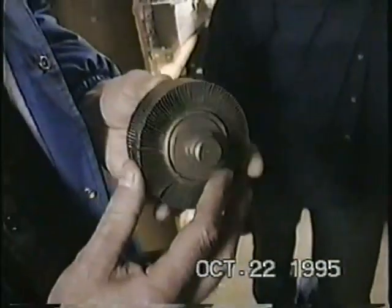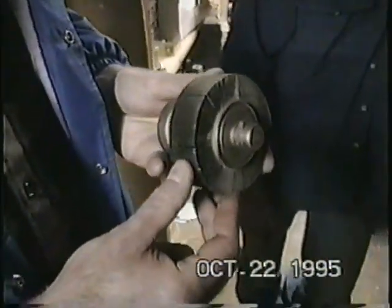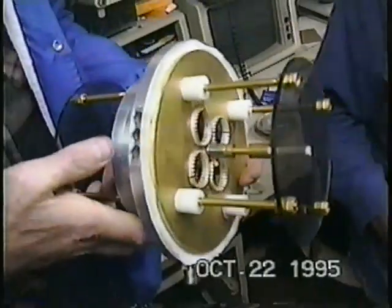If you ever see a 4CX 1600U Russian — how are those tubes? They won't run on 1296, I'll tell you that. Because Svetlana got ahold of me and asked me to build them a cavity, and I did. And the most I can get is 6 dB gain — and I said ain't gonna cut it. That's all I can get out of that on 1296. On 432 it's dynamite.